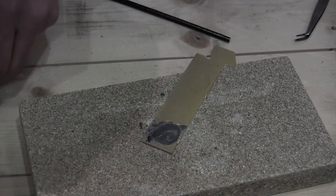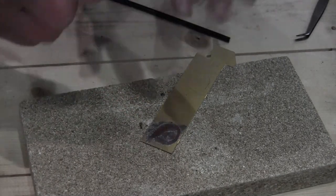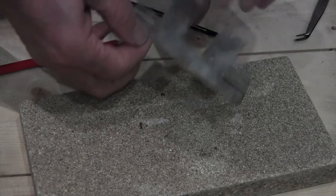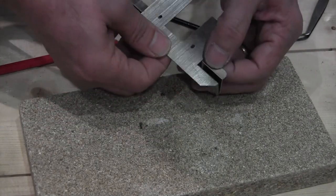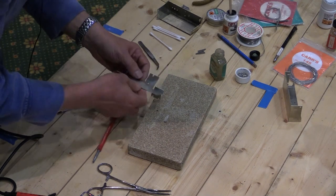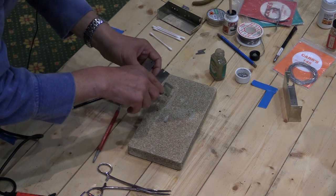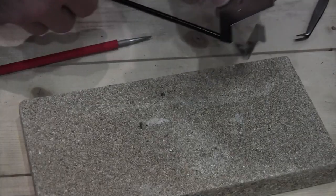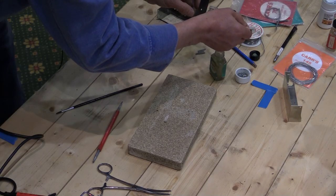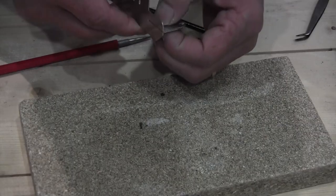Okay, so what you would normally do is you tin both pieces of sheet that you want to join face to face, but in this case I'm going to cheat. I've got this part of the etching, originally it was all one big flat piece, and they want you to fold this piece back on itself to create a double thickness. So what I'm going to do is put some solder paint in here, fold it back down,